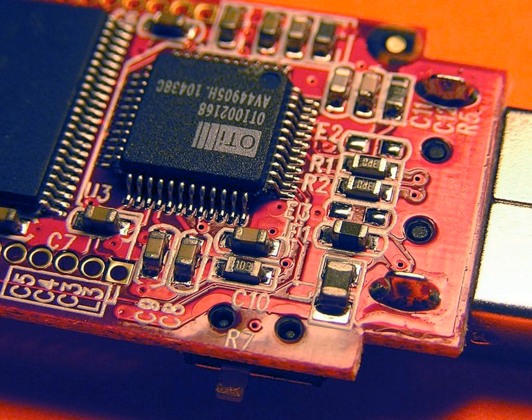The surface tension of the molten solder helps keep the components in place, and if the solder pad geometries are correctly designed, surface tension automatically aligns the components on their pads. There are a number of techniques for reflowing solder. One is to use infrared lamps; this is called infrared reflow. Another is to use hot gas convection.